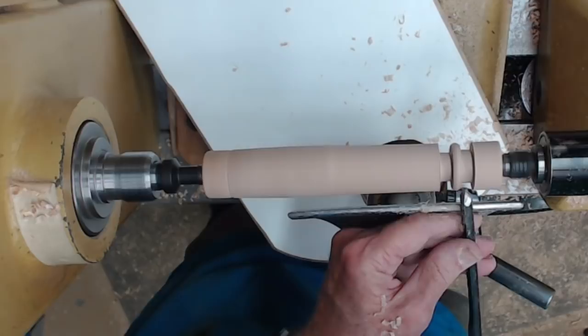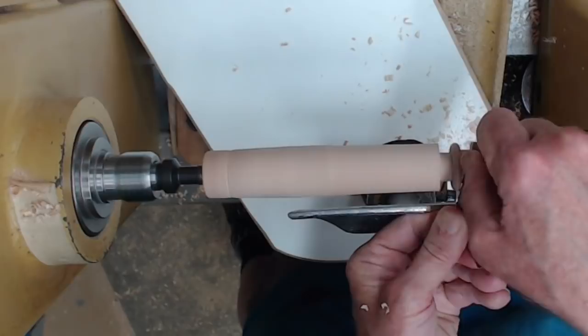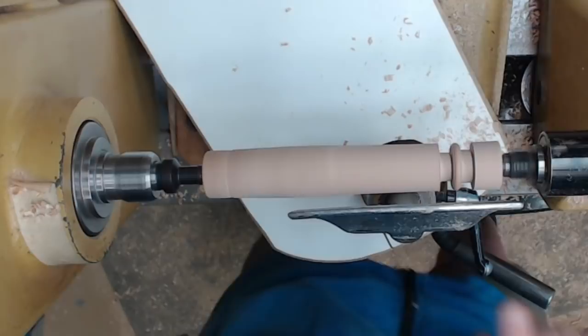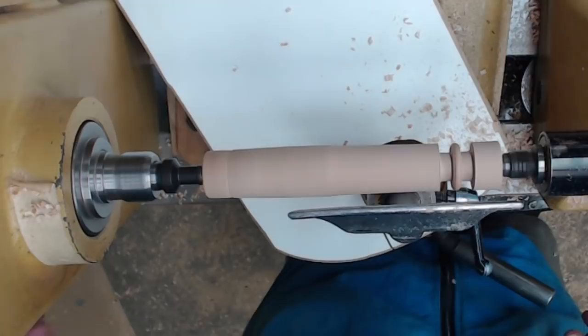If you've still got a sharp edge you can scrape the sides a little bit. Now the next step — before you go too much further — you want to go ahead and sand this, because you won't have a chance once this bead gets parted off and it's easy to forget. This side is a bit smaller than this side, so let me go back and tune this up a little bit, because you want each side to be about the same so when you part through they'll meet at the appropriate area.